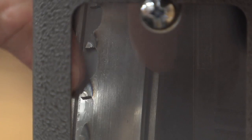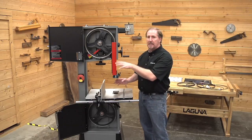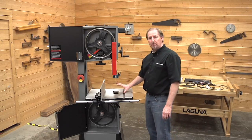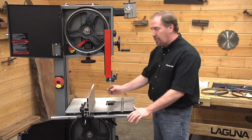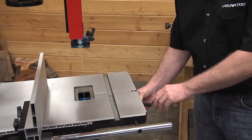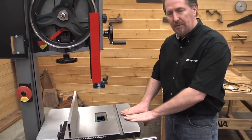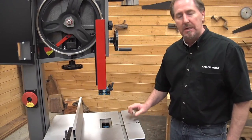Looking through the window, you can see that the blade is correctly centered on the wheel — it should be right in the middle. You'll find instructions for installing the blade, setting the tension, and tracking on pages 30 and 31 of your owner's manual. The next step is squaring the table to the blade, which isn't covered that well in the manual but is an important step. We're going to do that with the trunnions and setting the trunnion pointer. First, reinstall the lock handle that was removed when we put the table on — it slides into the slot on the side and locks into position. This knob ties both halves of the table together to keep them smooth and flat during normal saw operations.